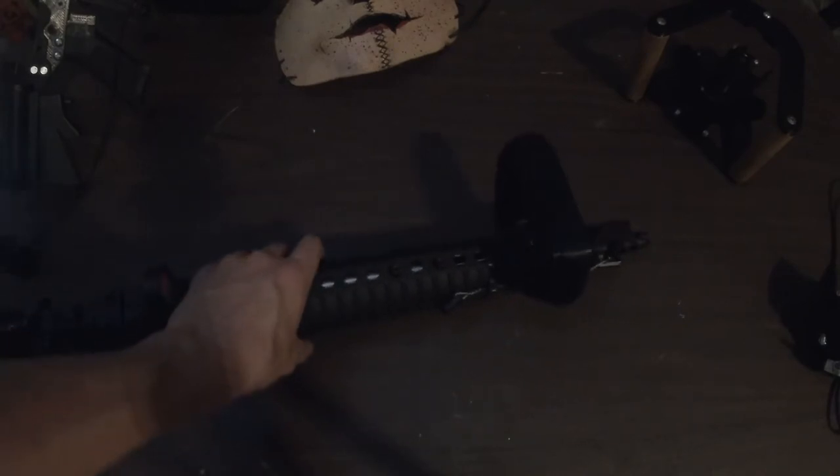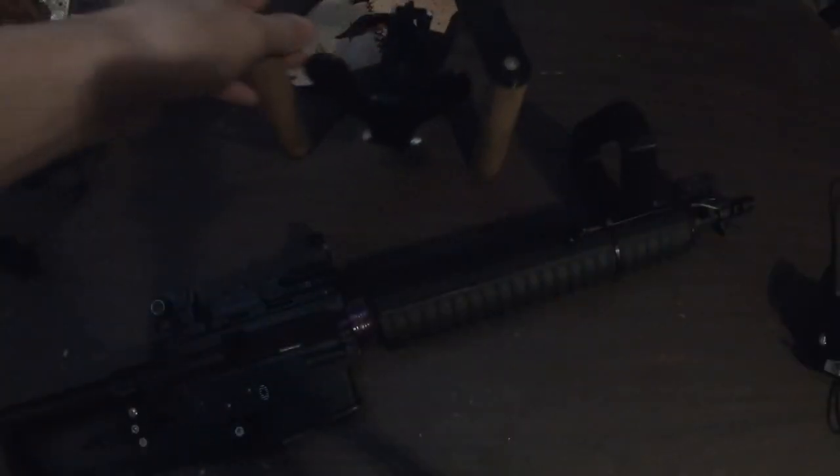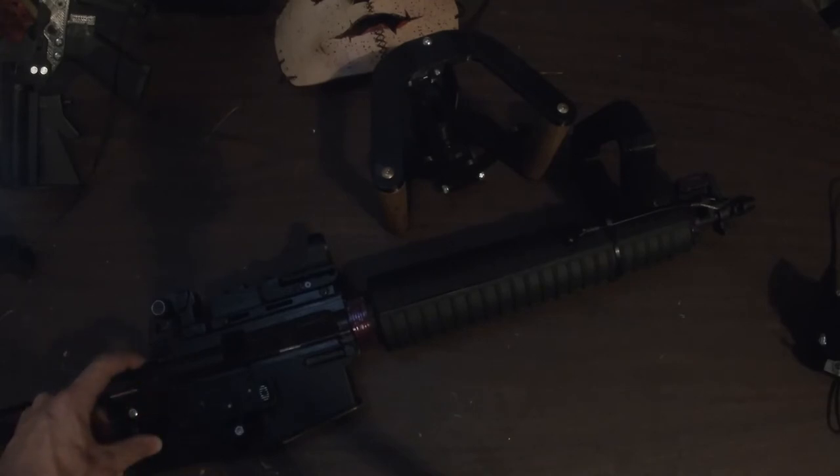The front grip you're seeing here is one that I've just designed due to necessity. I previously had a Zenit Core RK7 for a PK machine gun on the front of this, but unfortunately those are very hard to get now. I've just got this one zip tied on temporarily for demonstration purposes, because this is not the upper for this build. This upper, as you see on my spade grips assembly, is one I like to use for my prototypes. It's modular. This lower receiver has a 4-40 tap in the back of it, so it has a set screw holding this detent pin in place, thus not requiring the end cover plate, so I can change the stock fairly quickly with no extra tools.